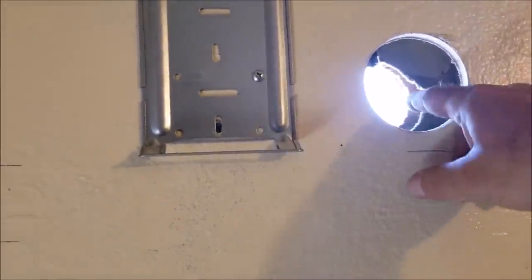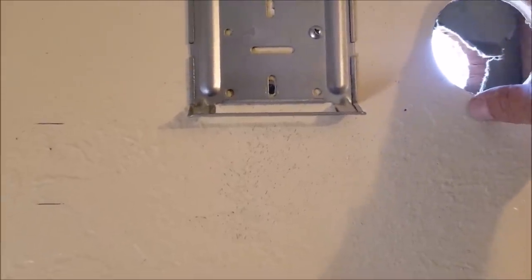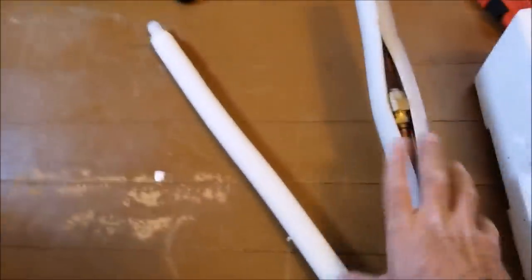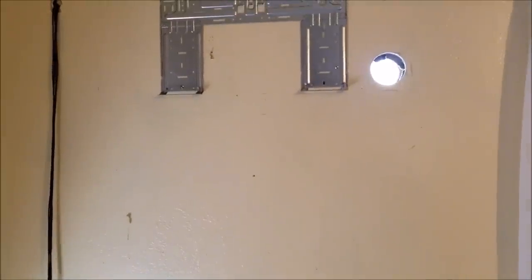You're going to need a hole to run the line set out, so I'm using a three-inch hole saw and I drilled straight through. You might get away with two and a half or even two inches, but I went with three inches. The unit is up there and mounted. Now I feed this — the line set from the unit — through the hole. It just sits on that top clip up there, and the bottom snaps into the two bottom pieces.